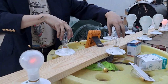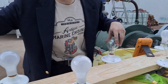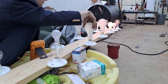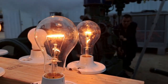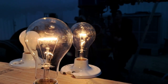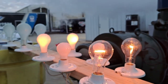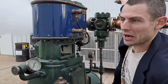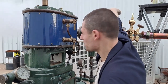Now the lower wattage lamps are taking up the resistance of the rheostat, and we just lost the field. So if I screw these back in, the electricity will flow through the field with greater current and the load will brighten. So that's the Ashworth Parker. I'm very sorry we're not exhausting into a condenser right now, and also sorry we don't have a proper switchboard the way I like to have, but we're making juice the proper way.